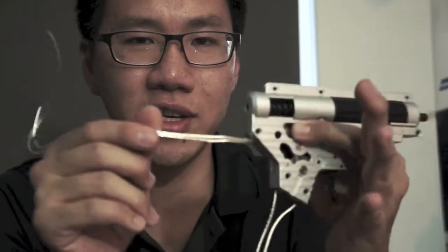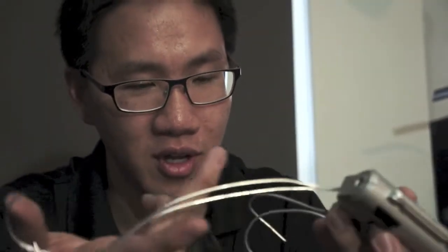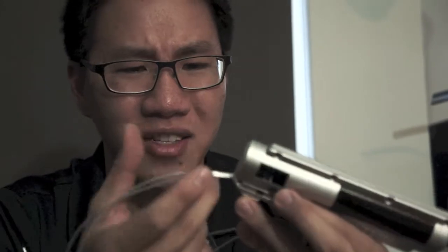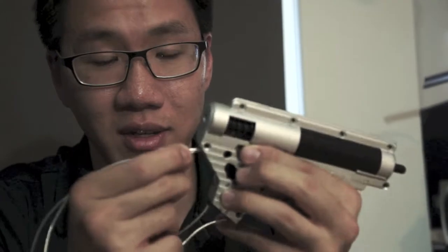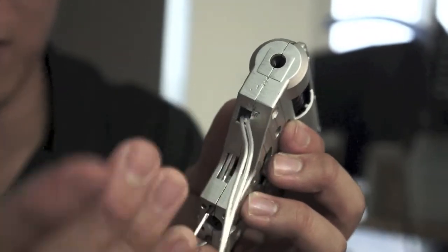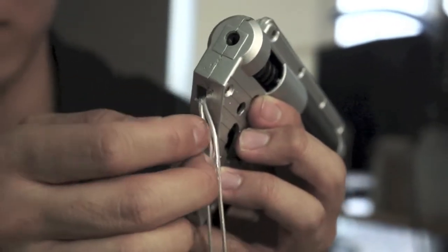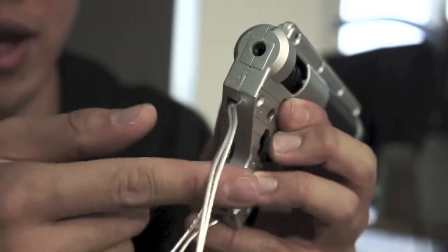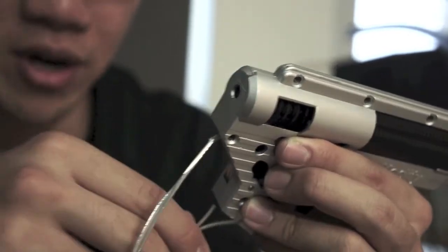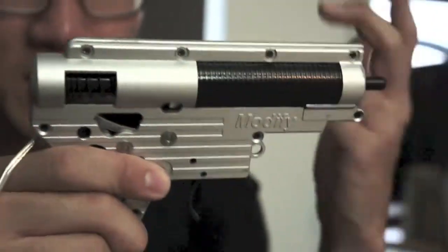What I want to go into now is the high-performance, low-resistance wiring. It's your typical sort of airsoft wire — high strand count, I think it's silver-coated. The biggest beef I have with this kind of wiring is the insulation. It just tears really easily. You can see here it's already started to tear where it was rubbing against the receiver, which is not good because it can basically cause a failure right there. I have to go back and shrink-wrap that. The quality of the wire is not bad, so they've definitely gone in the right direction — the insulation could just be a bit better.